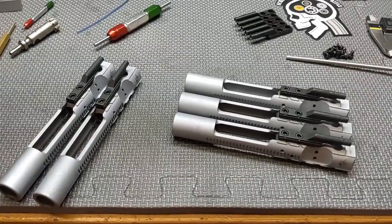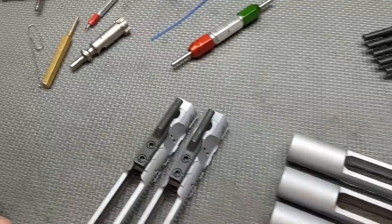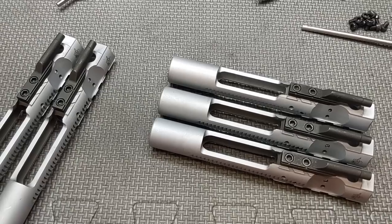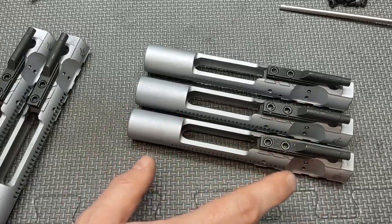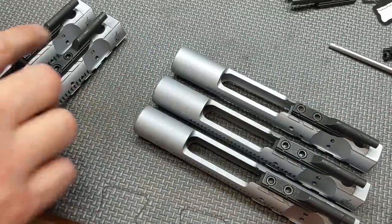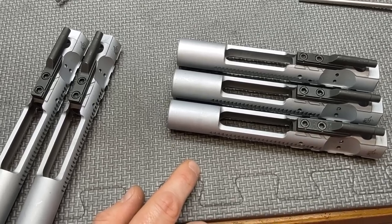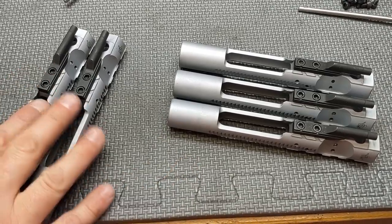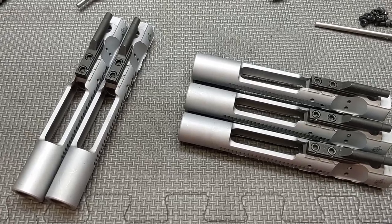Overall, fantastic physicals for these five carriers and the LMT bolt. It's one of my longer videos, but I wanted to be thorough since we're doing five separate examples here. I think across the board they were pretty consistent. We had some that had slightly better internal finishes on the bolt bore, slight variations in the gas key dimensions when we gauged it, but overall very consistent. There was only an inconsistency of 0.001 between three of the carrier bolt bores and these other two. So I hope you guys found this video educational, and thanks for watching.